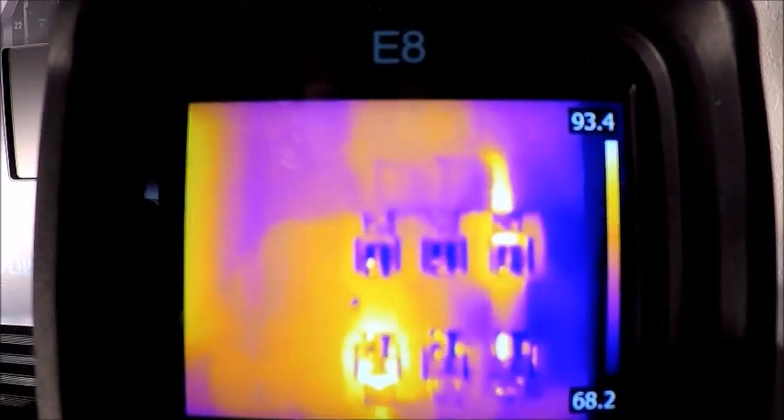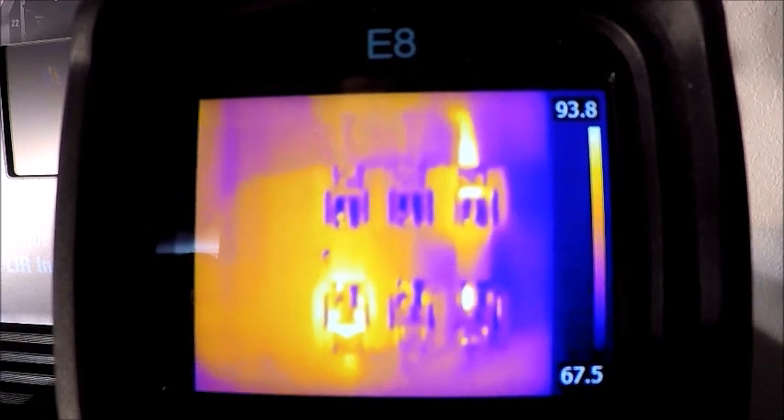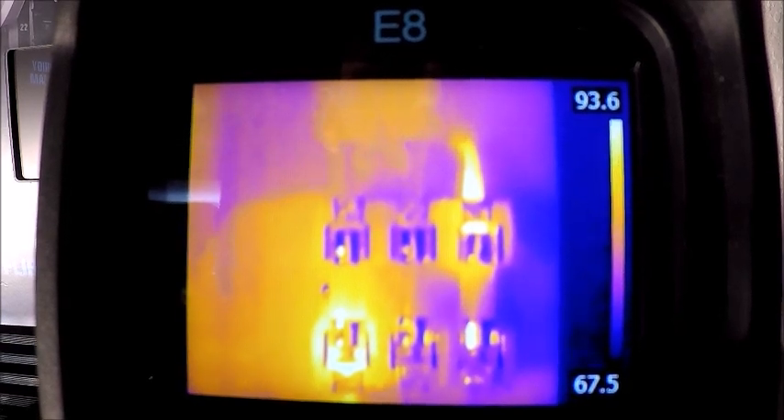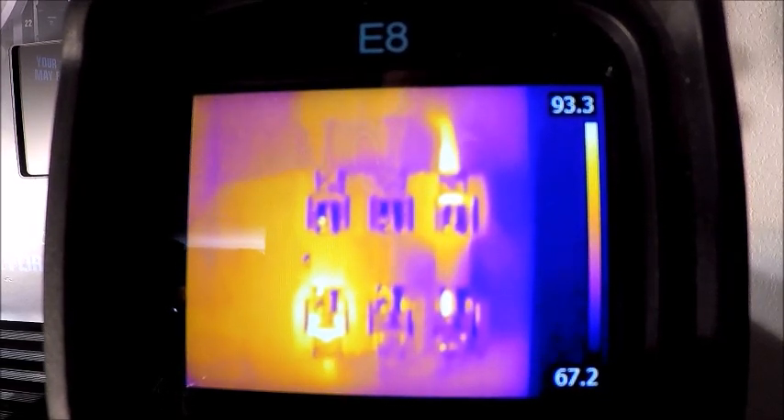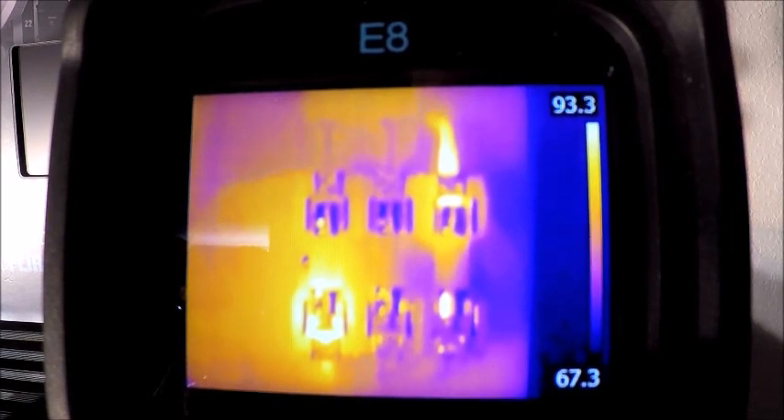Other than that, that's basically all we're going to have on the camera. It's designed to be a very simple operation, not overly in depth. There's a lot of other things we can do with this in the software, so I highly recommend looking at FLIR Tools to really amplify the features on the camera. All of the images that you take — whether in infrared, MSX, or with a center fixed spot — can all be changed from the software. If we dump images into FLIR Tools, we can do a lot more analysis: adjusting level and span, changing color palettes, changing spot temperature measurements, all image modes. If you took an image in infrared but wanted to send it in a report in MSX overlay mode, you can do that afterwards. Those are all radiometric data details that can be changed from the software.